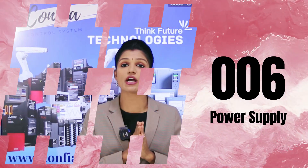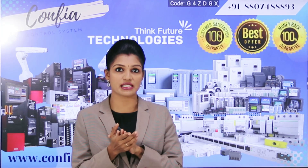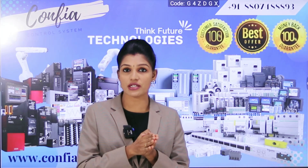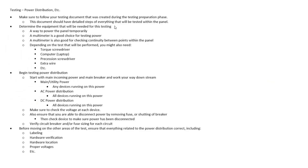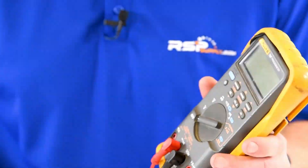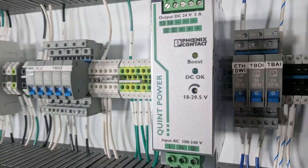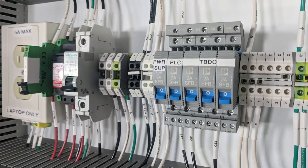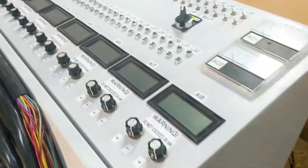The sixth tip is verifying the power supply. Always check the power supply's integrity, especially during a power surge or electrical disturbance, because voltage fluctuations may occur under such situations. Make sure the voltage entering the PLC panel box does not exceed or go below the specified range, as voltage variation may cause damage to the components inside the PLC panel box.